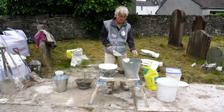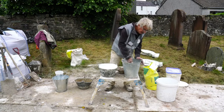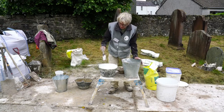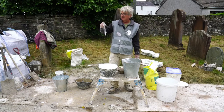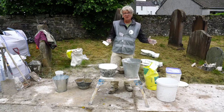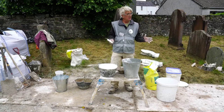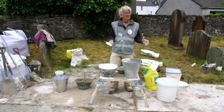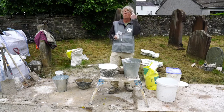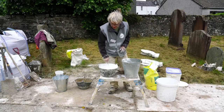That's this method, when we did the animal sheds and everything. And our rule was, the right thickness is when you dip a brush and you take it out, it doesn't drip. Anyone who's done lime washing with seven-water thin coat lime knows that is the messiest job in the world, and the job when you're most likely to get lime in your eye, in my experience. You hit a knobble of stone, poof.